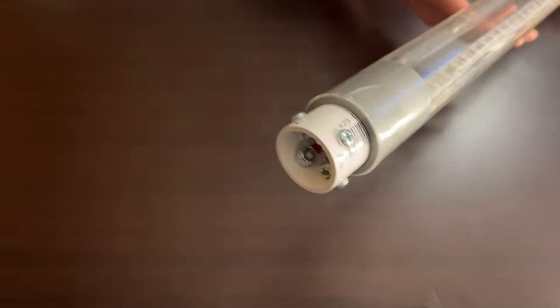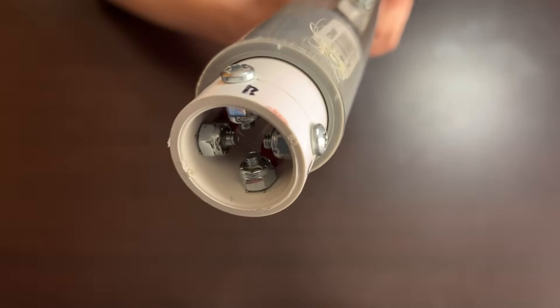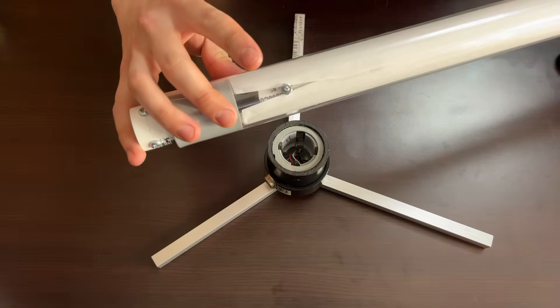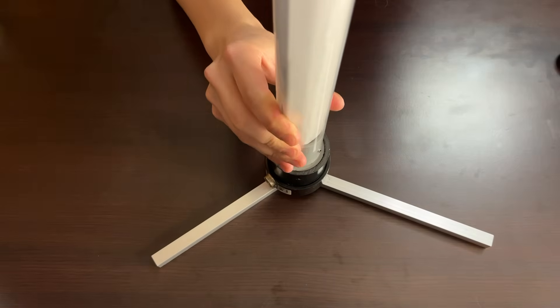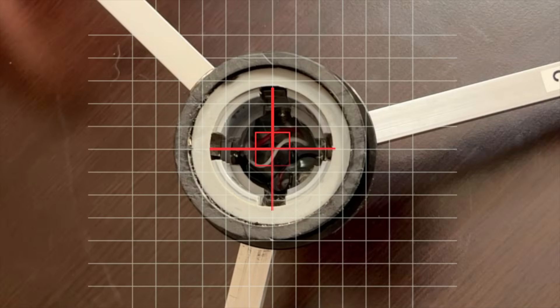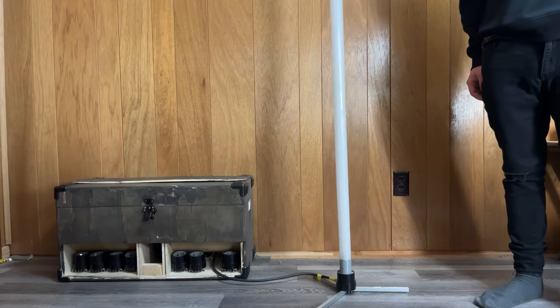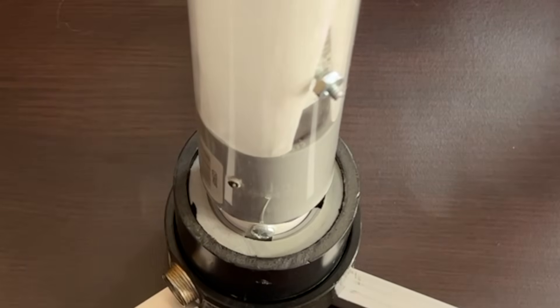I then put an ABS fitting into the end of the tube and soldered the LED strip to four screws that corresponded with the springs in the base. When inserting the bulbs into the base, I simply line up the back of the tube where the screws are to the back of the base and push down. I designed the socket with the springs equidistant from each other so that I could guarantee that the fixtures would sit inside the sockets with even pressure on all sides, so I'd be confident that the fixtures stood up straight — but this does allow the possibility of inserting the fixtures into the socket in the wrong orientation.